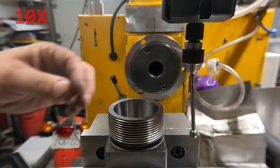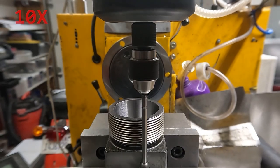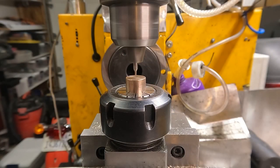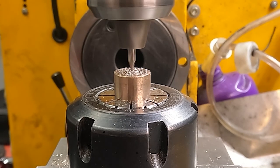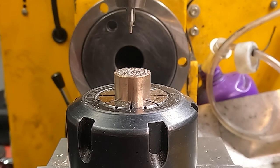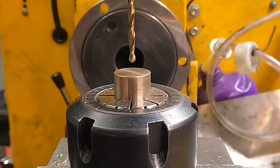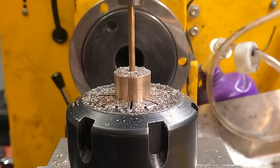This is a square collet block, so I can square up against the sides of the collet block. I really don't have room for my wiggler here — it is actually damaging the wiggler when it spins out like that. We do our initial center hole. There are two parts here, one on each end, and I'm just showing film from parts of each one. We center drill the hole in the center, then drill that down to depth — through where the part is going to be and into where the cutoff is going to be, about 240 thou deep. The two parts have a different center hole diameter and a different outside diameter on the boss. This is positioning with the CNC and then feeding down with the MPG.